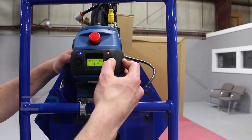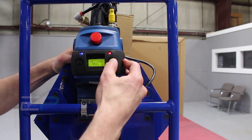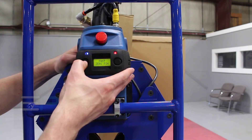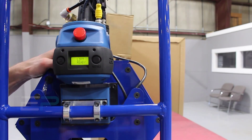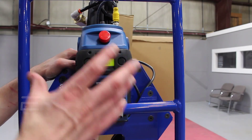The other feature you need to be aware of: when you have a force sensing hub — which is what they call this handle mount — you want to go in when you first hang this up and zero the FSH. Tap that left button, let it record the data, and now you have zeroed out the weight of the tool.